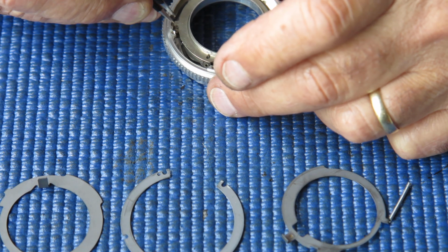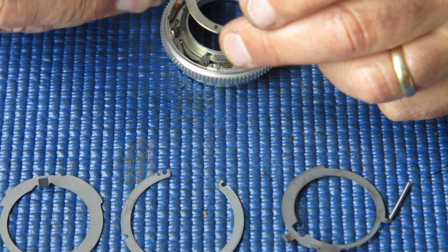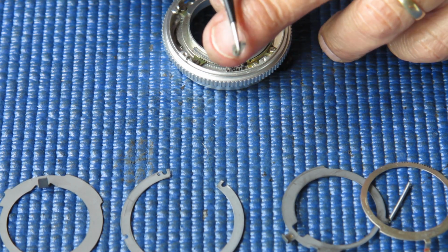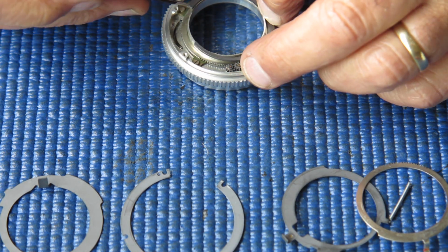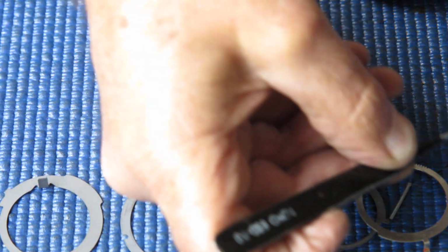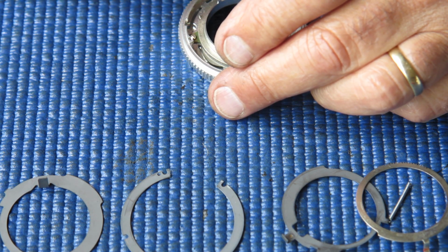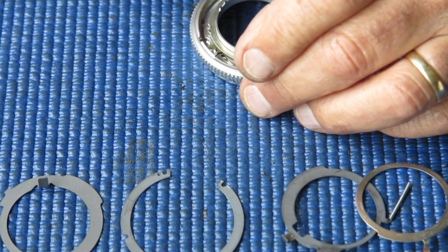Below that we have our first depth of field pointer, or in fact the second when we're assembling it. The little coupling cam here that went underneath that. The separator which separates the two depth of field pointers. I'll unhook the spring from this depth of field pointer and lift that pointer out.